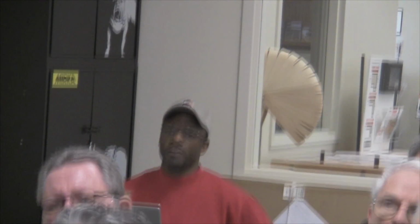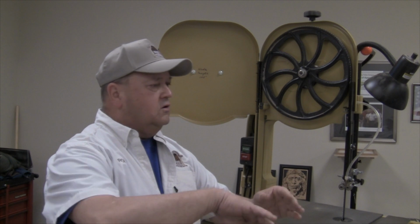Rob, going back to the cool blocks, when they start to wear unevenly, is it okay to sand it down flat? Yeah. And then you grease it again? Yeah. Okay. Well, on the cool blocks, not only can you sand it down, they're longer than what they need to be, and you can use both sides. So if one end gets worn down or isn't facing good, you can either sand that down or turn it around.